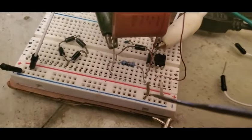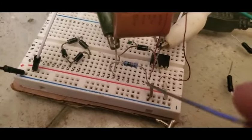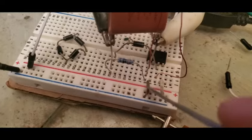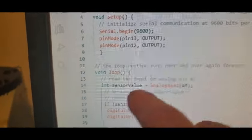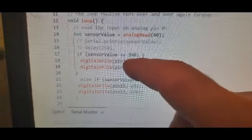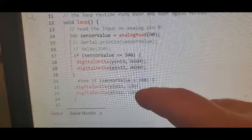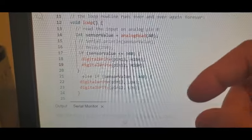So I thought, well, it's worth making and breaking both the positive and negative legs, and so I put in a second switch there for the negative leg. Goes to there, and then when that switch connects, it goes to there, and that lets it go to negative. So now you're making and breaking both the positive and negative legs. If we go to the Arduino code for this, it's just a few more lines, saying that pin 13 goes high, pin 12 goes high, pin 13 low, pin 12 low. So that breaks both positive and negative. And I tested that if either of them isn't functioning, if they're always low, then the thing doesn't run. And so it is doing what I think it's doing. It's making and breaking both legs.